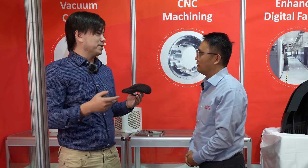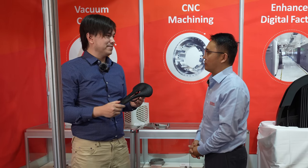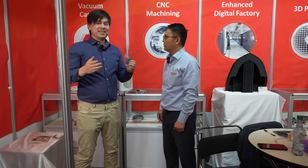How long do you think it takes to produce a quote manually? In general, by manual it's within six hours — we can quote the parts. That's not bad. And then we've got another TPU piece here. Was this made by the same SLS process? This one is by MJF. Multi-jet fusion — that's like the HP machine? Yes, HP machine. Those are fun because they're not using lasers, they're using just a really high-intensity light to heat up the powder.